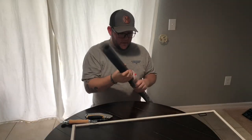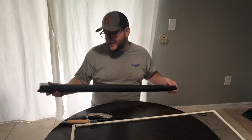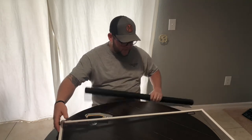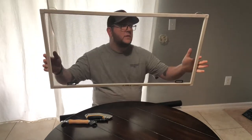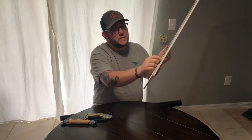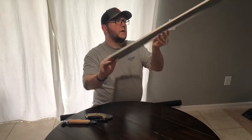And just like that, you're done. Sometimes they go in nice and straight and tight the first time; sometimes you've got to work with them and clamp the corners down. But the more times you do it, the easier it'll be. Save the leftover screen because you're probably going to need it again. There's your brand new, nice and tight, undamaged window screen. Remember, those little window screen pull tabs are held in by the splines — if they fall out, just clip them back over the edge, put the spline on the screen, and run it through.